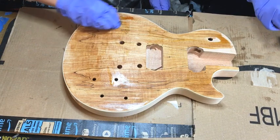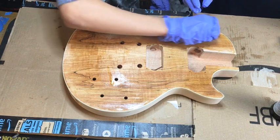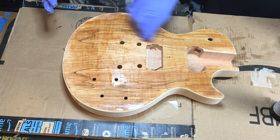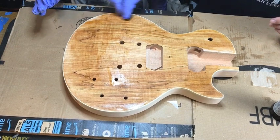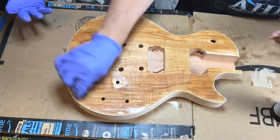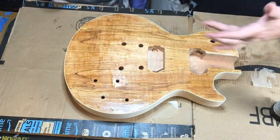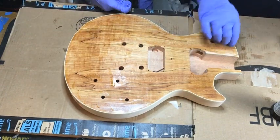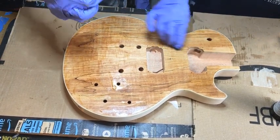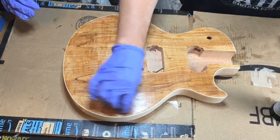As you can see, this thing is going to look really, really nice, and it's going to gloss up the more layers we put on. Just kind of go around in circles — you're pushing it into the wood. When you get near the edge, just kind of go thin because we don't want to push too much over the side. If you've got some close to the edge, put it in like this — just push it down in and don't get it too thick near the edges.